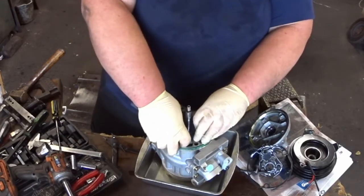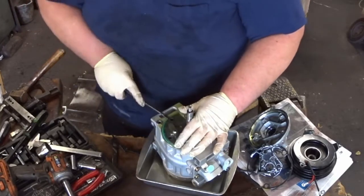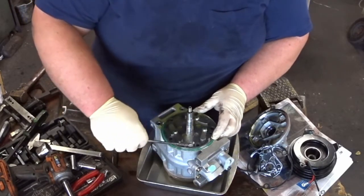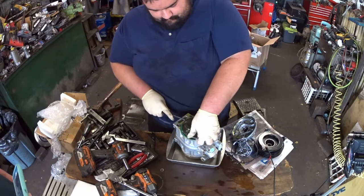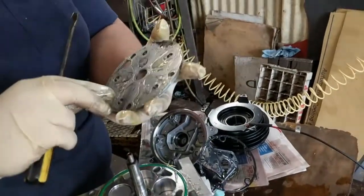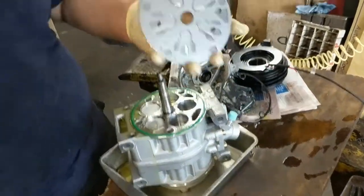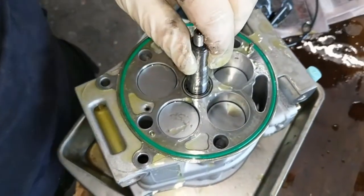There's a front gasket sealing the front head, and then we have suction and discharge valve plates. The suction and discharge valve plates usually stick down pretty good because of the oil. Note there's an alignment pin on each side that prevents them from rotating to give proper alignment when assembling. We have one valve per cylinder — this is a 10-cylinder compressor. That is our front head.